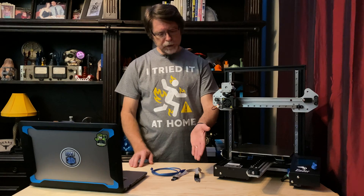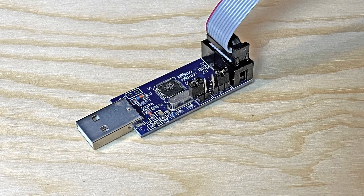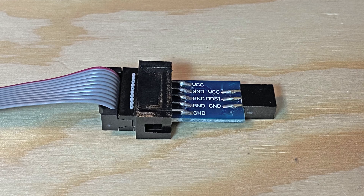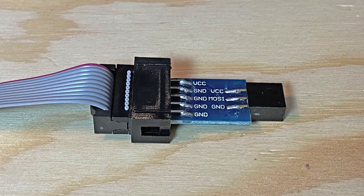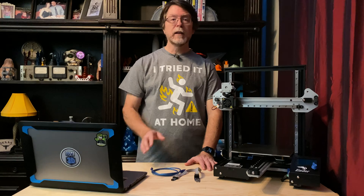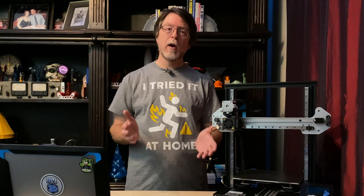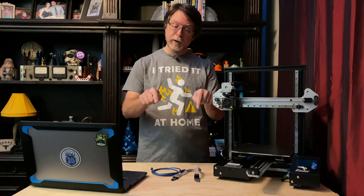Lastly, we're going to be using a USB ASP programmer. It has two connectors — one is USB and that plugs into your computer, and the other is a 10-pin header with a ribbon cable, and the other side of that ribbon cable plugs into a 6-pin adapter, which then plugs into the programming header on the printer's mainboard. The programmer I purchased from Amazon included a 6-pin adapter; however, the 6-pin programming header on the mainboard is too close to the connector for the LCD screen, so the included adapter couldn't be plugged in and I had to buy a different adapter with a narrower connection on the 6-pin side. You can pick one up on Amazon along with one of these narrower 10-pin to 6-pin adapters for about ten and a half bucks total. There are links in the description.